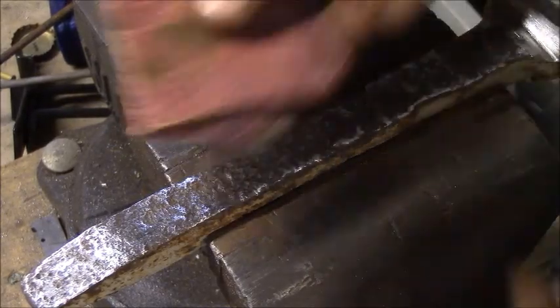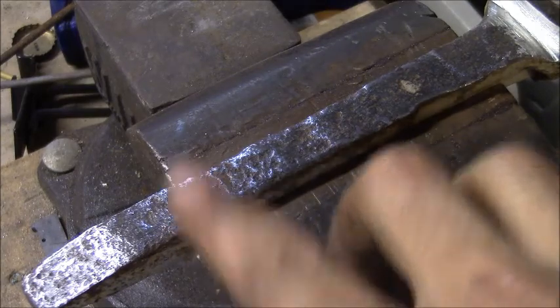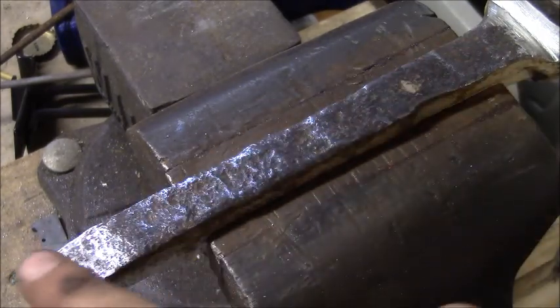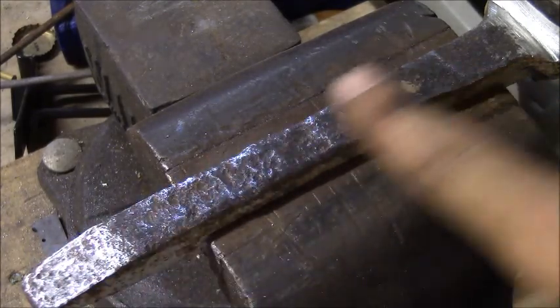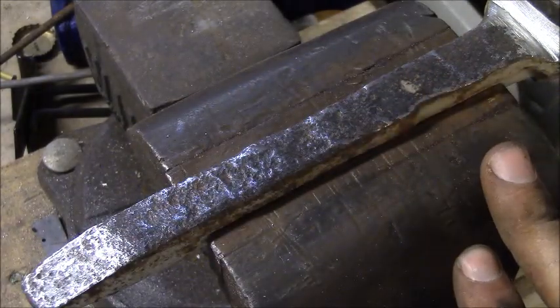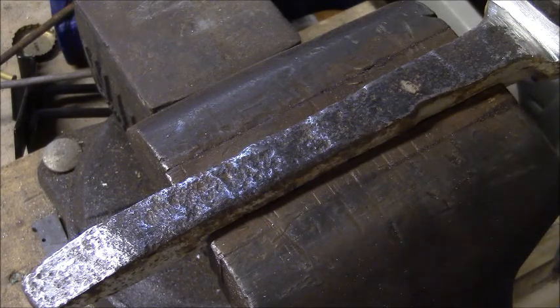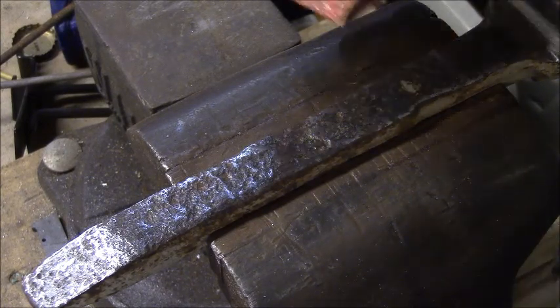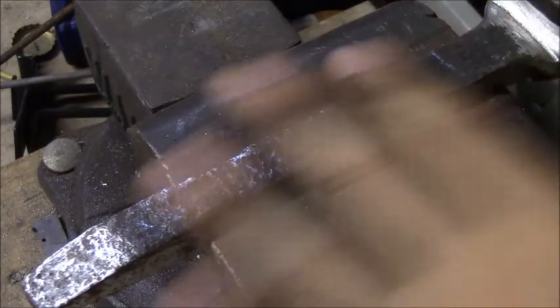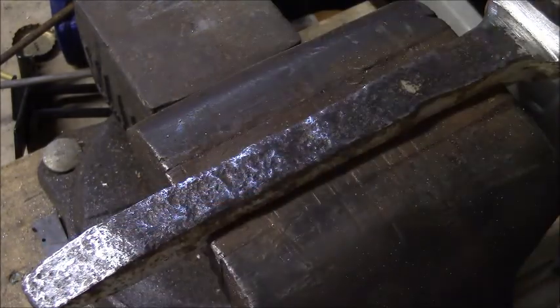What I figured out was just using 60 grit sandpaper and sanding it like this. This is the look I was going for — all the high spots are shiny and all the pits are kind of dark. There's still rust in there, but they'll turn really dark black, which gives it almost like a wrought iron or forged look. That's really what I was looking for. I've just been using this 60 grit sandpaper — this only took me about five minutes — so I'm going to do this a little bit more, flip it, and keep going.